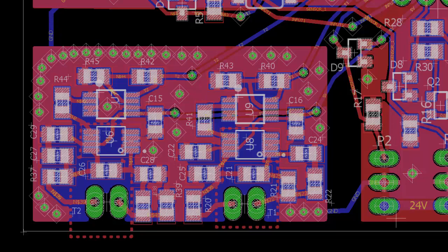Now you might say, well, you could get a ground loop. You could get ground currents flowing through here to here. But these circuits above this really don't have high current. And I only connected the bottom ground plane. The top ground plane is only connected via vias.